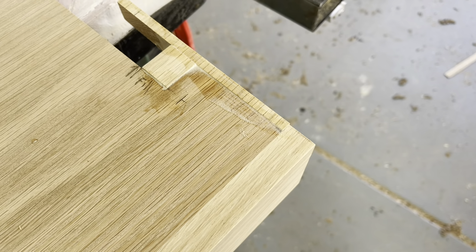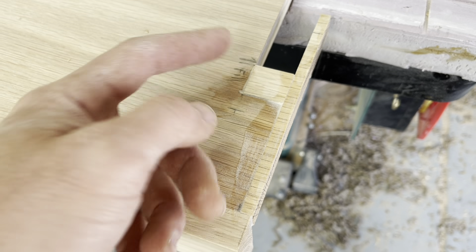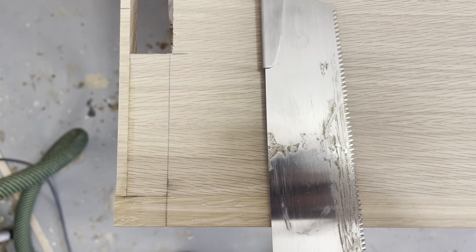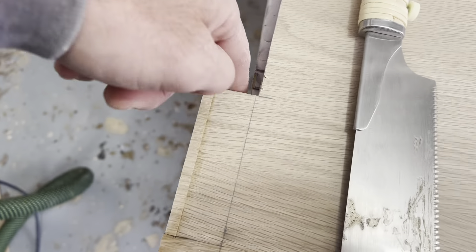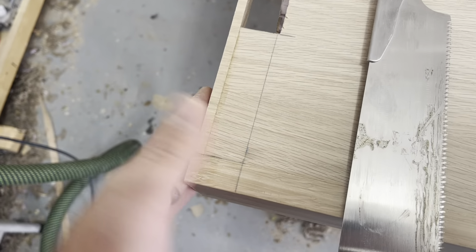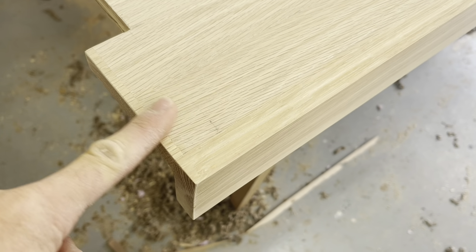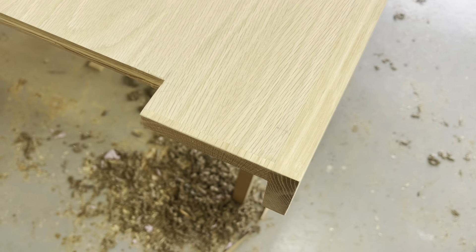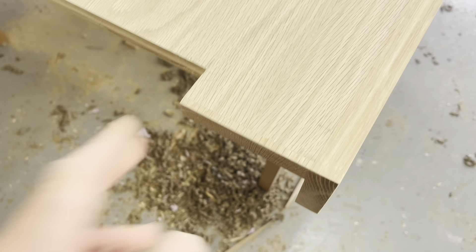There's the glue-up — I promise it's going to look a lot better when it's finished. Notice how I overlapped the top of the plywood on both sides: it doesn't matter that it's long because once it's dried I can sand and cut it to where it needs to be. The glue's all dried up, so I'll use my Japanese razor saw to flush it up against this edge, then sand it gently flush with 100 grit. I also colored the seam in with pencil as an indicator — once I've basically flushed it up you can see a little bit left. You don't want to go through all the pencil because that's a sign you might be getting into your veneers too much.